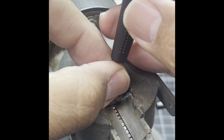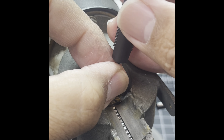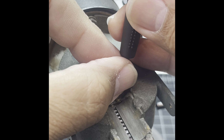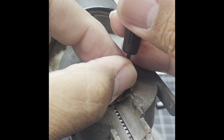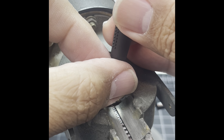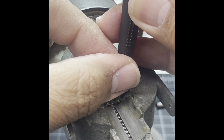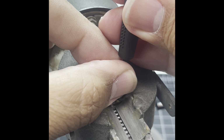And one trick about when you do these, don't crank them down tight, because these are really soft. The metal, it's not really that great. And you're just holding down a little piece of foil. Just take your time and tighten it so you start to get each side a little bit tighter. What I don't want to do is have this little brass plate that's holding it down buckle. Because if you tighten one side too tight and then do the other side, it could actually do the opposite, not tighten down, but kind of bow up.